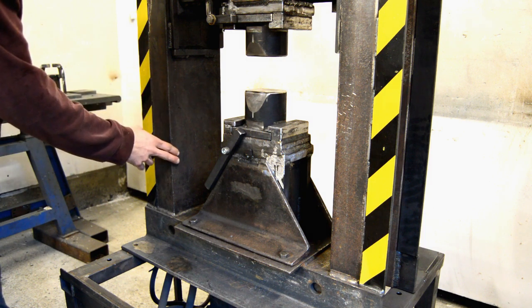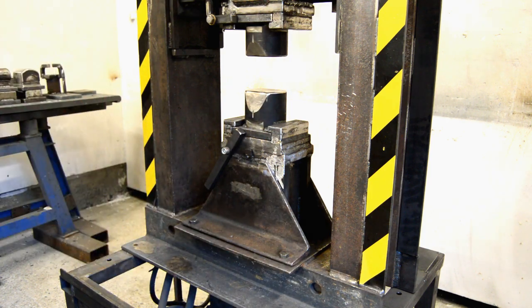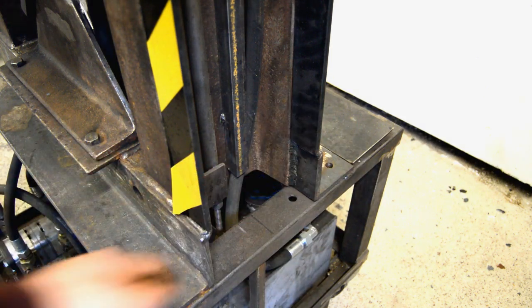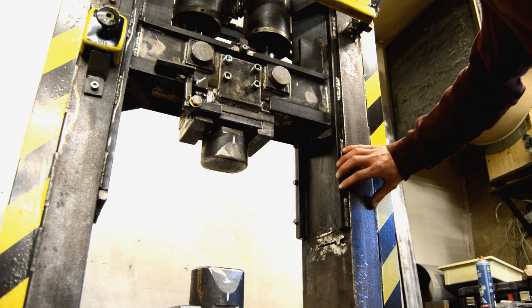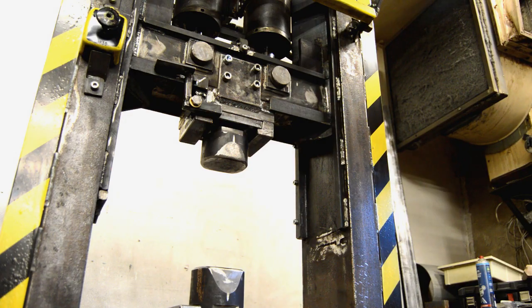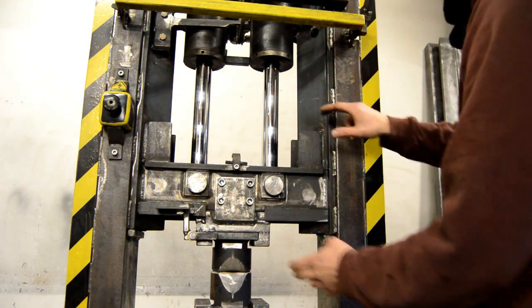The frame itself is made out of C-shaped beam and I welded some flat bar to it to make it stronger, so it goes in a C-shape. The horizontal parts are made from massive L-shaped beams. I run all the hydraulics, controls, and wires inside the C-shaped beam so they don't get damaged. The ram runs up and down guided by metal bars — this side is welded and this side is bolted on, so I can unbolt it and remove the whole ram. The ram itself is this big U-shaped piece.